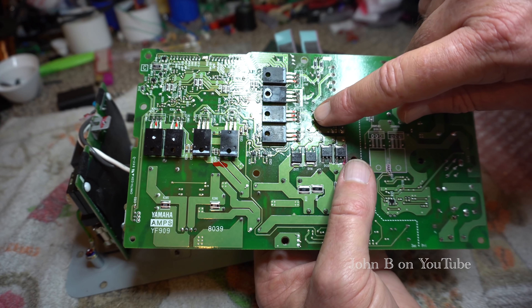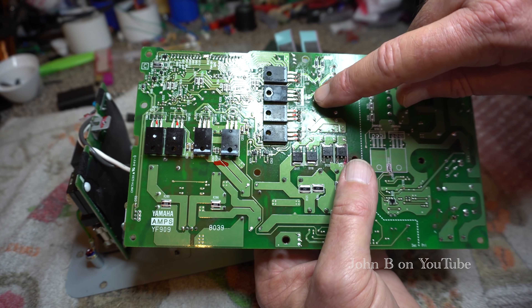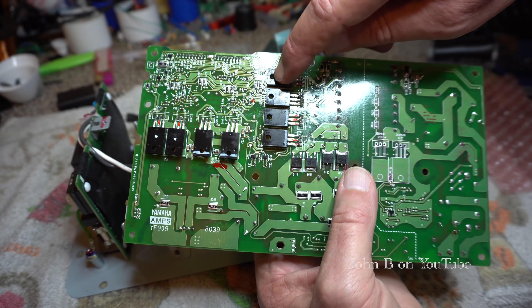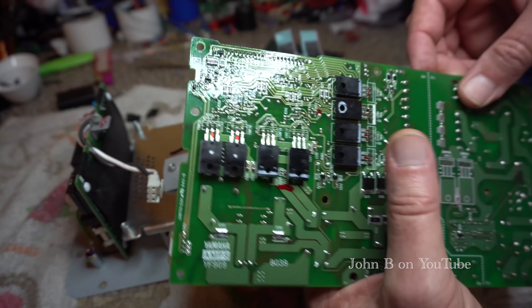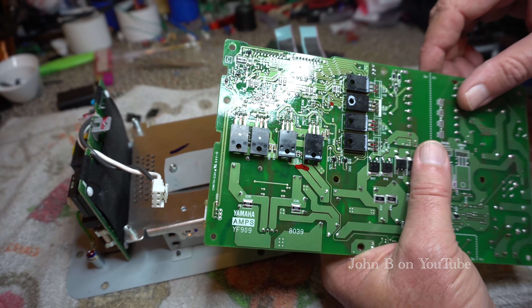I think I saw a 7815, 7915 — so that's negative 15 — and another 7815. So presumably they're driving different circuits that have got to be isolated from one another, or the circuits need more than one amp or 1.5 amps. So these are all regulators, and these are rectifiers. I don't know the supply rail voltage yet, but when I test it, I'll have a measure. So bass, treble, four regulators, rectifiers — and that's it.